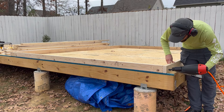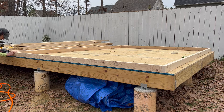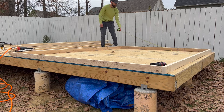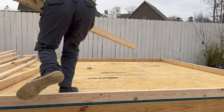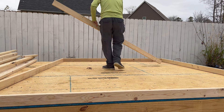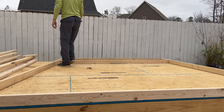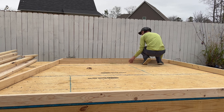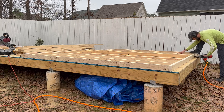Getting the four outside pieces in place and nailed together allowed me to easily measure the length of each stud and get them cut down to size. I simply made a measurement from the back edge of the mark on my bottom plate to the back edge of the mark on my top plate, and then cut a board with the slope of the roof, which was 11 degrees in the top. After repeating that process several times, it was time to nail all of the studs in place.